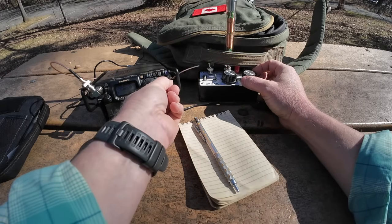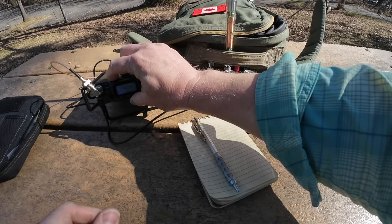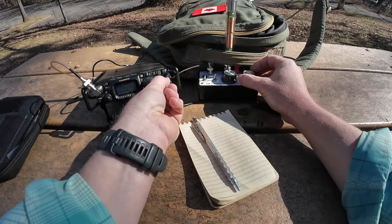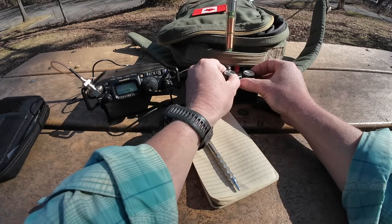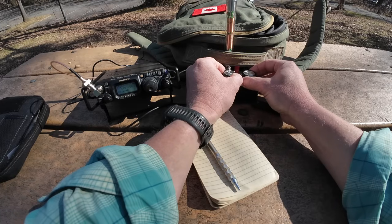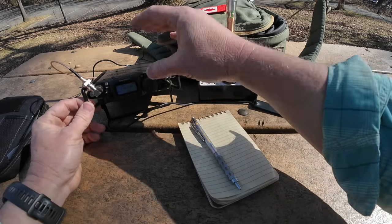and then I listen for the noise. In fact, what I'll probably do is move this mode to AM mode. AM has a lot of noise, which actually makes it a little easier. There's some really bad RFI that I'm not picking up terribly on. We'll see how close I am now. What I do now is I move it back to CW mode.